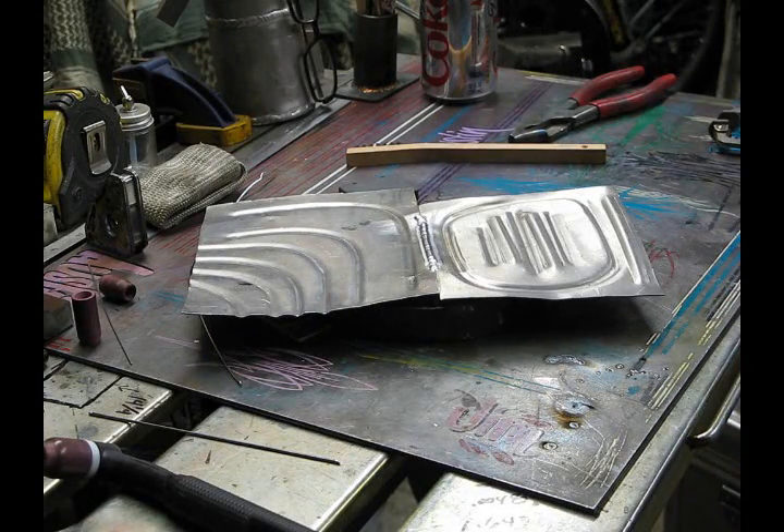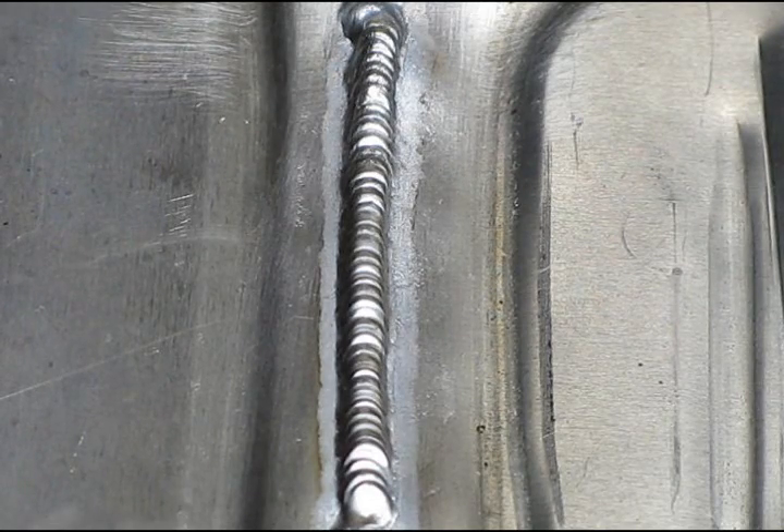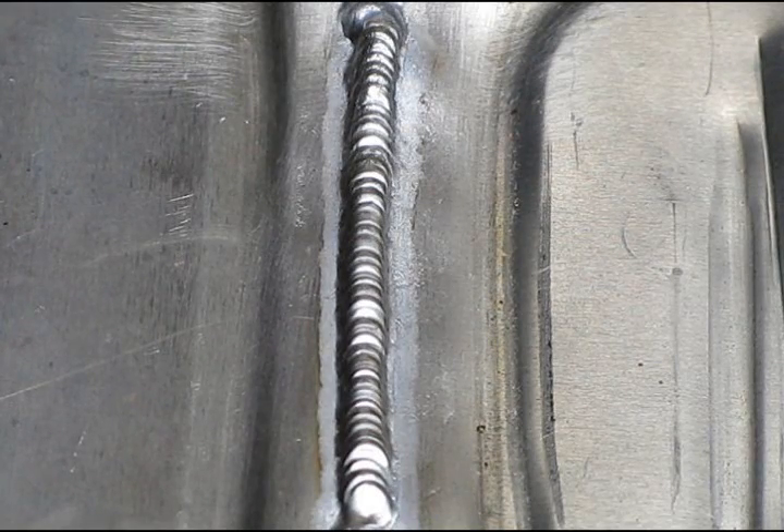I'm going to bring the camera a little closer so that you can get a look at it. So there you can see with 40 amps, 3 pulses per second, 160 hertz on the frequency and low side of 55 percent, you've got a really nice bead on 40 thousandths aluminum that doesn't burn through. You don't have to stitch weld it — you can just weld right across the seam and you won't have any problems. And if you look at the cleaning action there on the heat affected zone, it's nice and tight, it's not spread out all over the place. And that's a nice feature when you want to do some work and not have to have a lot of after-weld cleanup.